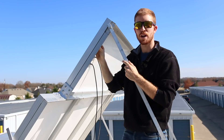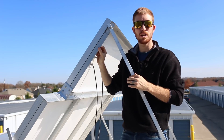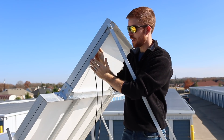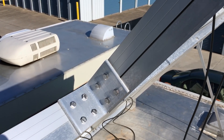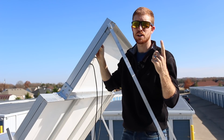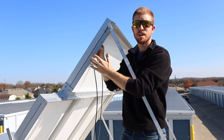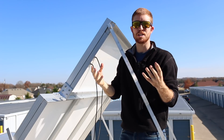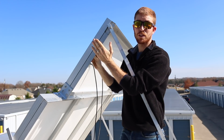When I went to build this custom mount, I had to figure out how I wanted the solar panels to align together, then I went to a local steel shop where they had aluminum angle that I bought to create the framework. The framework is two by two aluminum angle. Aluminum is lighter, and also the frame of the solar panels is already made out of aluminum. The guys at the steel shop said some metals can react weirdly together when exposed to different weather conditions, so I went ahead with aluminum to keep it light and compatible.